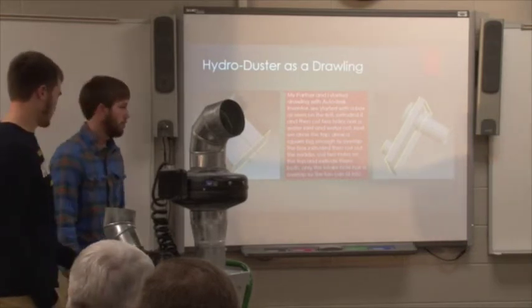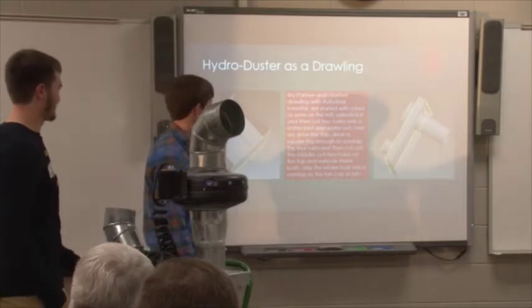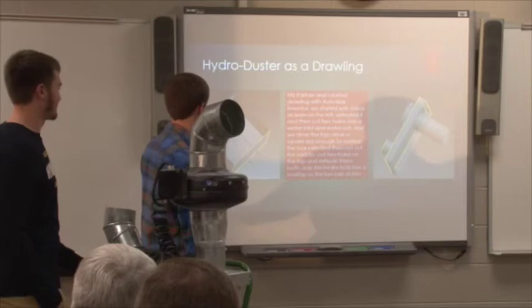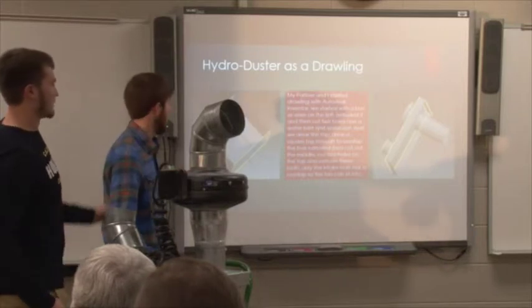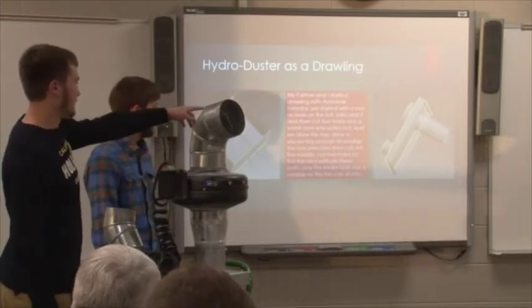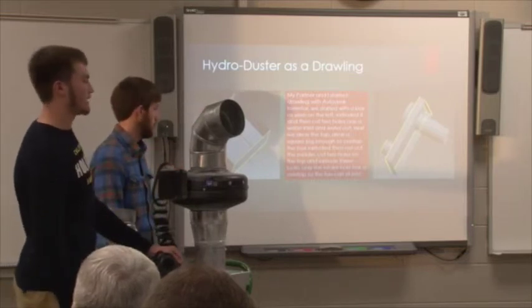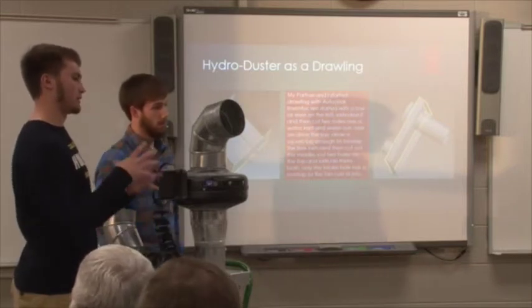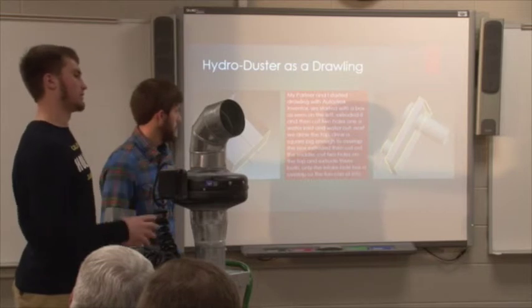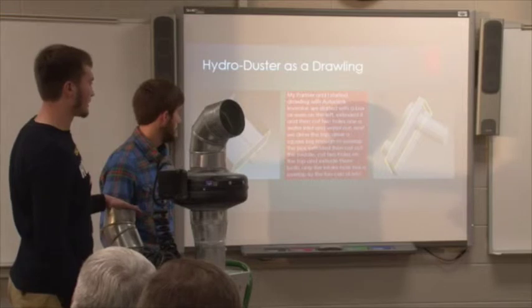That is in the file that I'm talking to you about, the Revit file, Autodesk. Basically, it's a 3D view, and that was our blueprints. On the right side up there is the intake. The long piece right there where it comes in is where the fan sits, and the water comes probably about 1.5 inches, 2 inches up above it, to where when the air blows down after it goes for a while, it kind of just blows the water like that, and opens up, and it just sucks the dust back into it and traps it, and then lets the new air out this side right here.